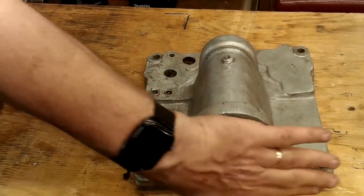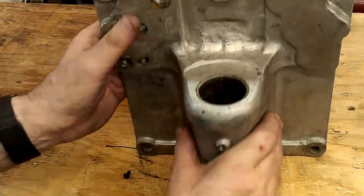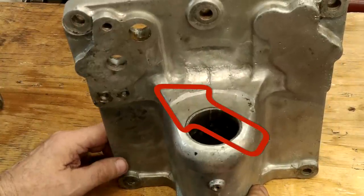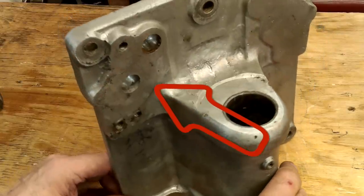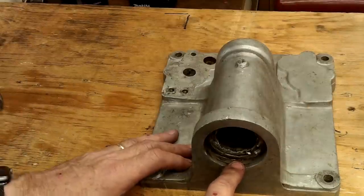Skim the bottom face. Skim the top yoke face. Bore the bearing seats. Drill the fixing holes. Skim the sloping face. Drill two angle holes at 47/64th diameter — that's about 19mm. And drill and tap some fixing holes. Job done.